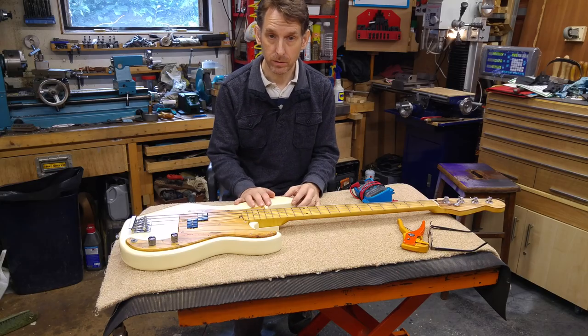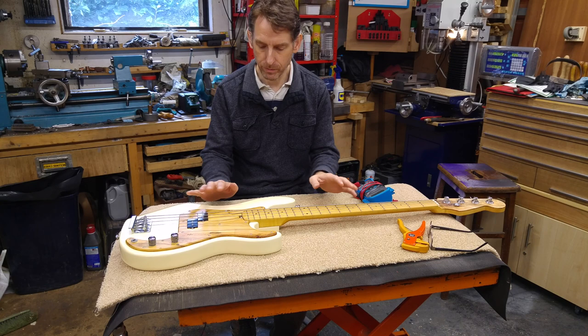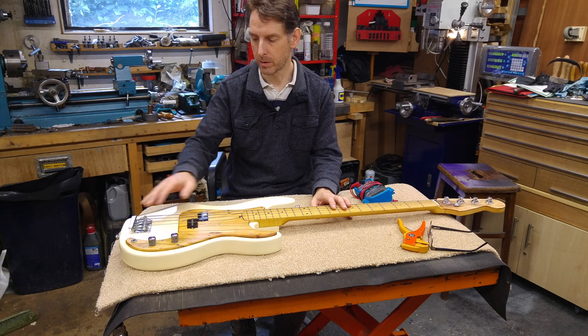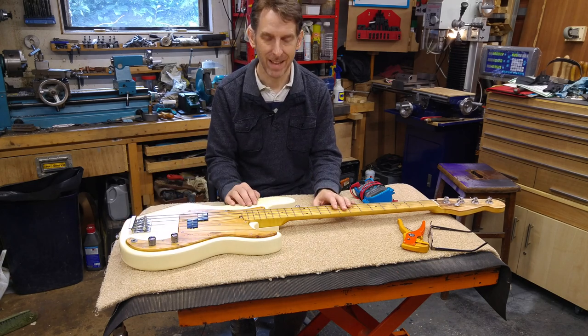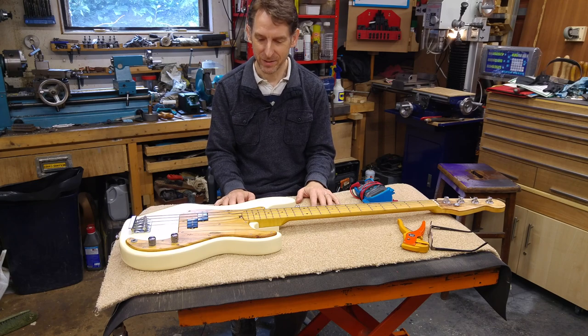The point of all that was that you can quickly work out whether you actually have a fault that you need to sort out. If you haven't got continuity then there is some sort of problem, and at that point you're going to start taking the bass apart to see if there is actually a wire under there, or whether it's connected right through. I hope it's been useful to you. Please like, share, subscribe and all the rest of it. Thank you very much. See you in the next one.